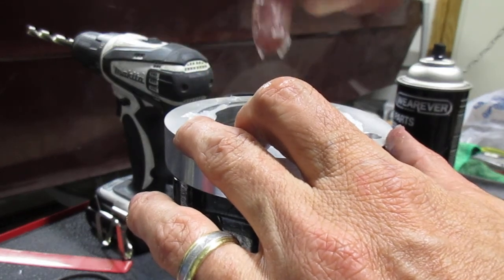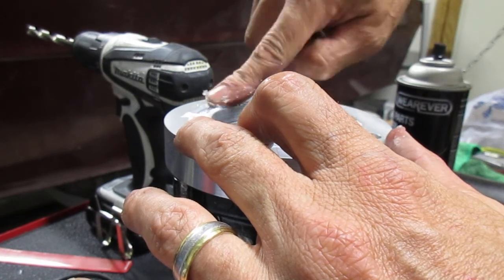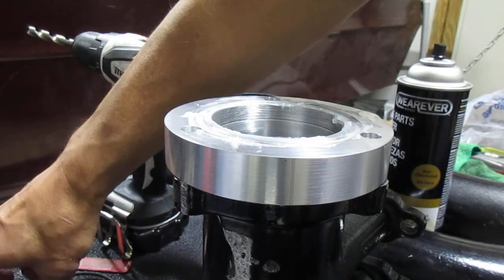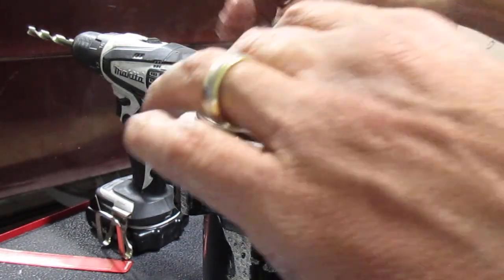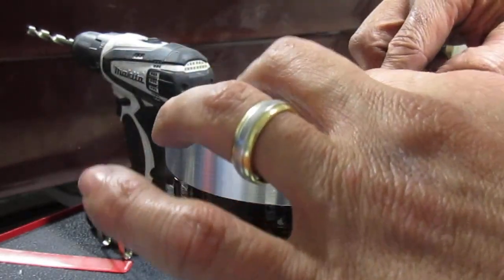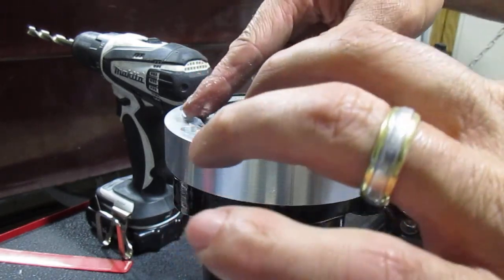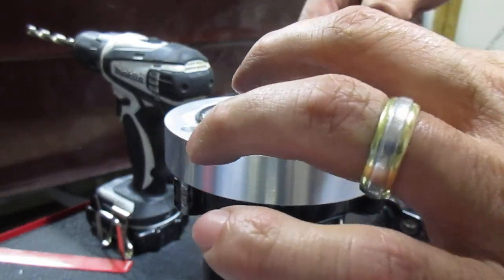Some of you are probably thinking I'm crazy at this point, but this works for me. There's nothing wrong with this silicone — it's not going to hurt anything. A little bit in there. The ring sits in there nice. I followed the specification for an o-ring groove of this size and it actually came out really nice. I just duplicated the o-ring that it's called out for here.